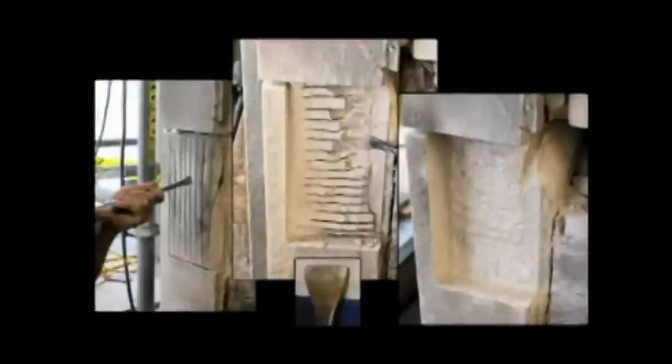In this sequence of photos, the removal of the stone is done with a pneumatic chisel, with great care given not to chip or spall the surrounding stone areas. The final cutting is done with a toothed chisel to increase surface bonding of the natural hydraulic lime, which is the material used to increase the strength of the Dutchman repair once placed.